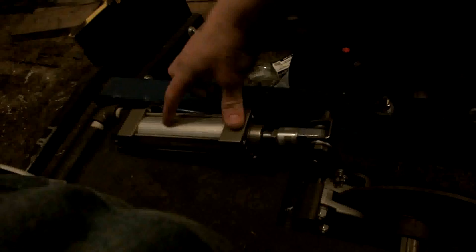So when you release the brakes, air rushes in here and pressurizes in front of the cylinder, pushing the piston back. The air that was behind the cylinder when it moved back gets pushed out of here and goes out the exhaust port. The opposite happens when you apply the brakes. So this valve controls where this pressurized air goes. This one or this one, apply or release. When it's in neutral, all the ports are blocked and it keeps it in its position, keeping the pressure in it.